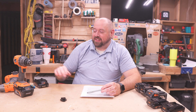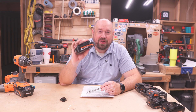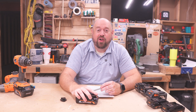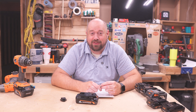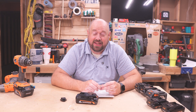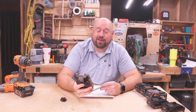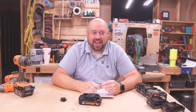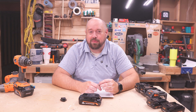Now as I mentioned, one of the big benefits to a tabless cell battery is going to be the charging characteristics. When you pair the 4 amp hour EXP battery with their 6 amp charger, which is going to be their more rapid charger, you are going to see some pretty impressive results and they're actually touting that you can get 80% of the battery charged in just 15 minutes. That is one place where definitely these tabless cell batteries really shine — they're just able to put energy in faster and also take it out in how they provide it to the tools.